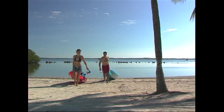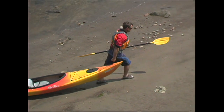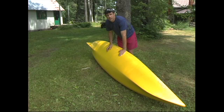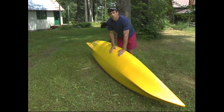One of the greatest things about plastic boats is that they can take quite a beating and still work fine, but they will show signs of their abuse. You don't need to worry about scratches in the bottom of your boat unless they're really deep. It's actually quite normal for the hull of a plastic boat to deform a bit over time. If you get some serious warping or denting, heat will often be enough to return the boat to its original shape.